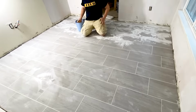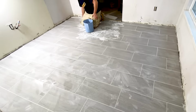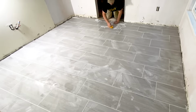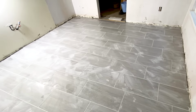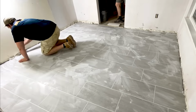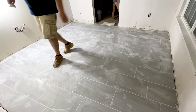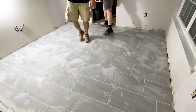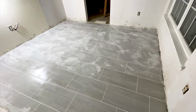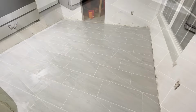So by the time you finish the room, it's possible that you can go back and start leveling the grout. As the grout dries, it will form haze on the tile surface. You may have to make several passes to clean up the haze with a slightly damp sponge and clean water if necessary. And finally, wait 72 hours for heavy use of your tile. Don't apply sealers or polishers for the first 3 weeks, and then only according to the manufacturer's recommendations.